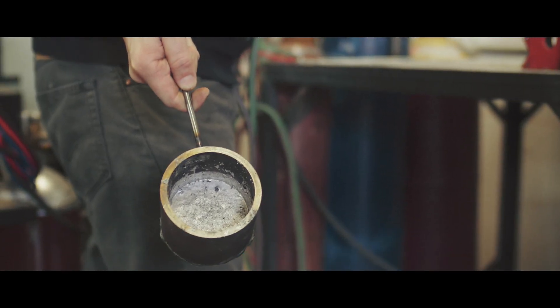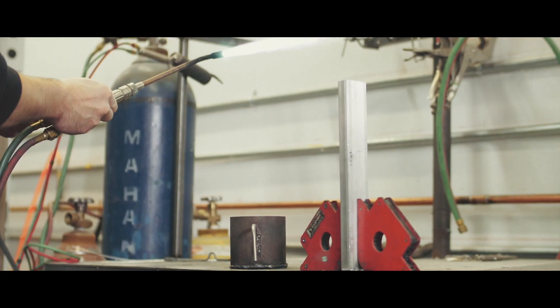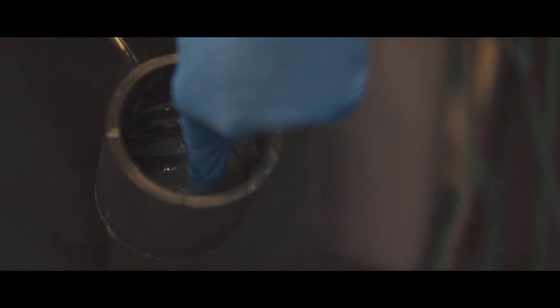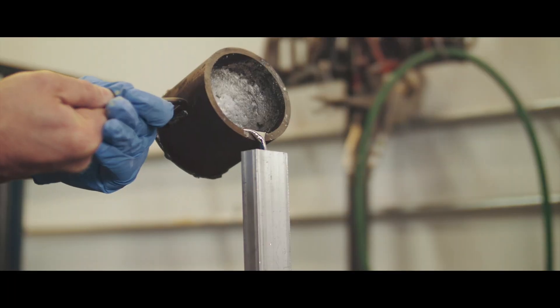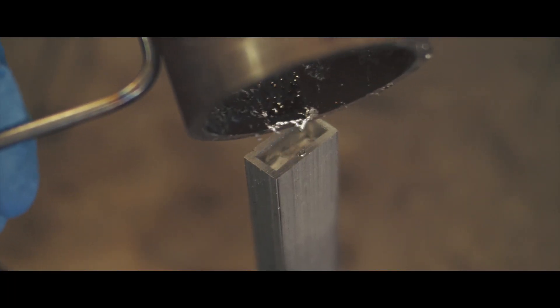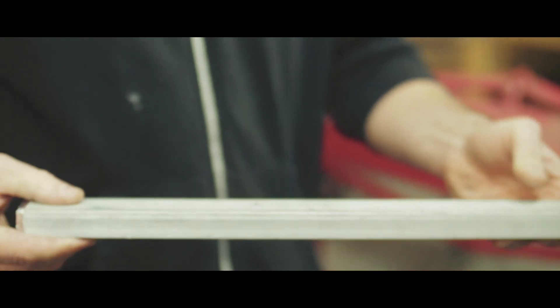This is the low-melt bismuth alloy. You can see it's rock hard right now and I'm just going to add a little heat and get it up to about 160 Fahrenheit. This has also got cadmium in it, which is something you want to avoid a lot of contact with. Just to demonstrate how low this stuff melts — you can see it's really not that hot. But don't do that with your bare hand because it's got cadmium and that's nasty stuff. That's your solidified bismuth alloy — it's got a lot of weight to it, and this metal will bend but it's going to make this whole thing bend just like a solid tube of aluminum.